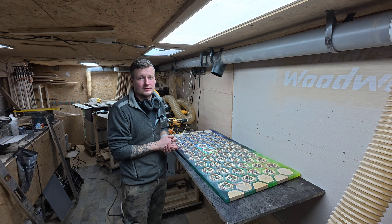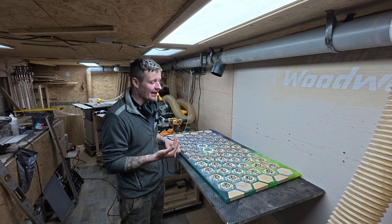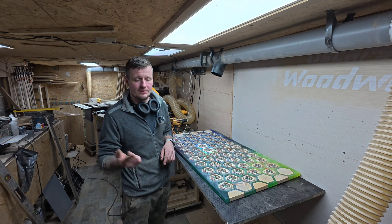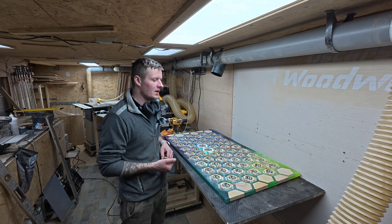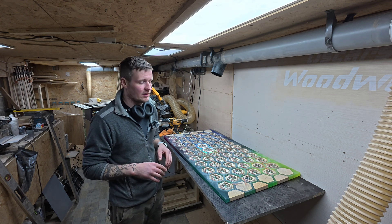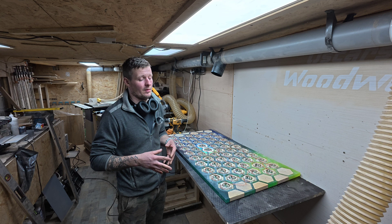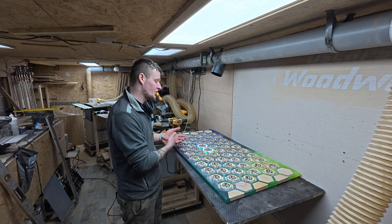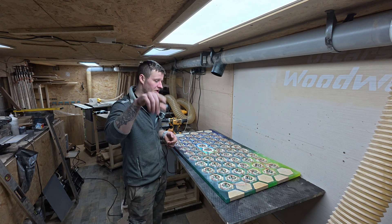If you have questions, I really hope I explained everything — the bits and bobs. It's really simple to make — you need that jig, then epoxy pouring and stuff like that. Be careful with the epoxy: depending on which epoxy you're using, the pour depth can be up to 20mm or up to 50mm. Don't overheat the epoxy resin — just go slowly, step by step. I'm going to make one video soon where I make the table step by step so you can see how I do it. If you have more questions about the sensor or anything, just comment below. Thanks for watching and see you on the next video guys.